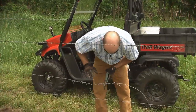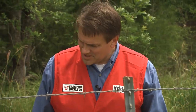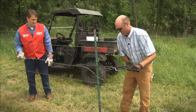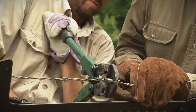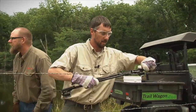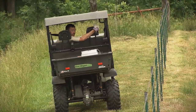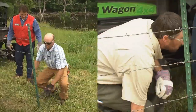It's always good when you have these kind of unexpected breaks because you've identified a future weakness and we're going to fix it one time instead of twice. Mark, with the wire stretcher in place on the second break, using the twisted loop method. See if you can get that right about in the middle — just haul on it, all the way down. Okay, where's our sagging wire? Good job, Mark — it's right here, down there on the bottom.